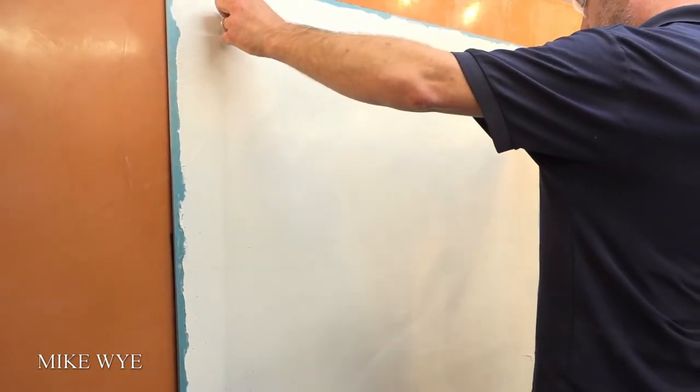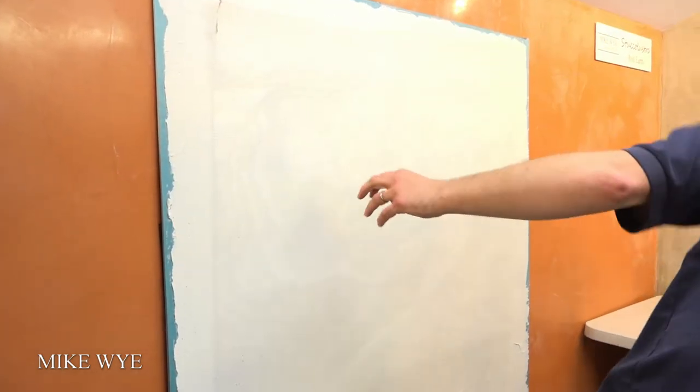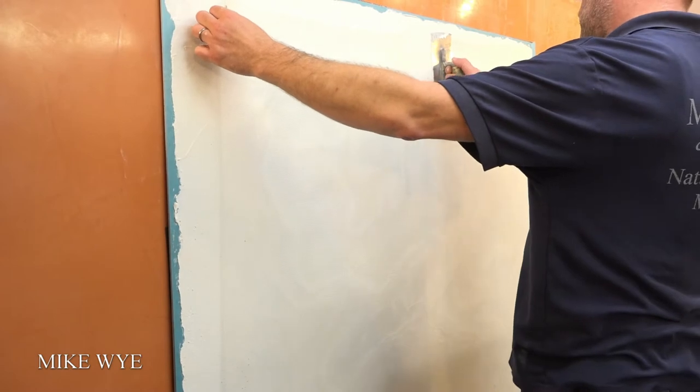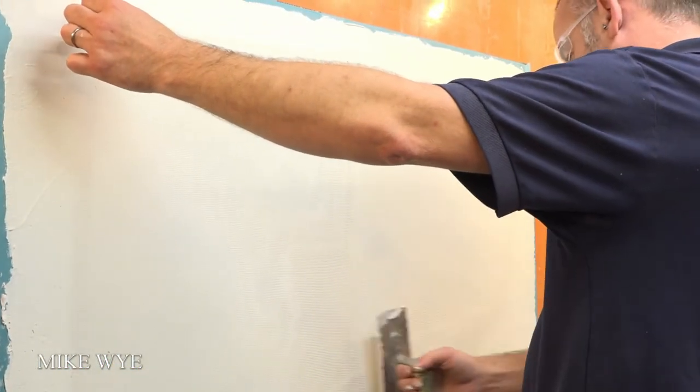The lime wall finish is applied in about a 2mm thickness with two 1mm coats with a mesh embedded. The mesh will hold itself there when pushed into the first coat with a trowel. The second coat will bury the mesh so you don't see it through the finished coats.